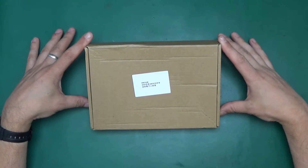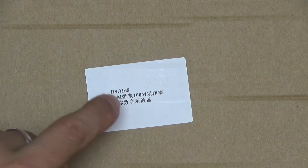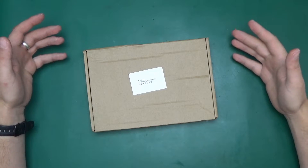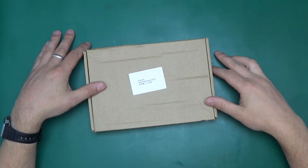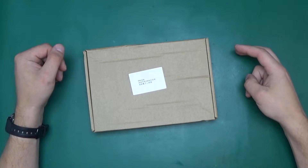The box says DSO168, label reads DSO16820M100M — claiming to be 20MHz, 100 megasamples per second. This is a pocket oscilloscope. There are plenty of little tiny oscilloscopes on the market and to be honest they're all junk. There are two reasons why pocket oscilloscopes are junk in general: bandwidth and sampling rate. Most of them have a bandwidth of a couple of hundred kHz — good really as a toy, it's very difficult to measure anything with them.